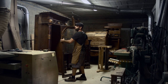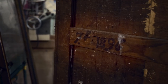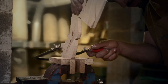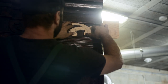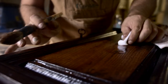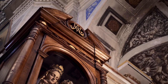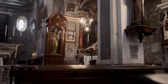This is a vitrine going to the Eglise de Pente. It's a beautiful armoire, and in addition, they are both signed and dated. I'm going to make a piece that is missing — it's a floral scroll that has broken off. I'll make the same form, basing myself on the model from the left side and making the mirror image for the right side to replace the missing part. Like on the other vitrine, I've done all the cleaning, removed all the old paint layers, everything that was applied before. I treated it as if it had aged naturally over time without negative intervention. I also redid sculptures that were missing. Now it's in place, and I hope it will remain in this state as long as possible and keep its éclat.